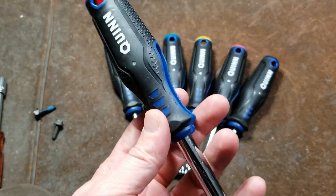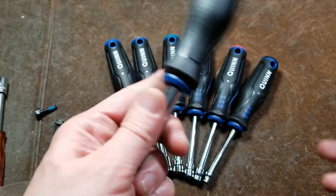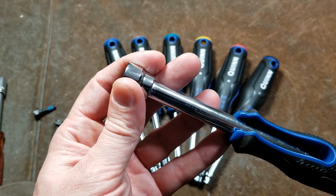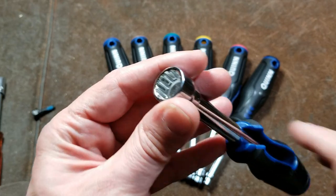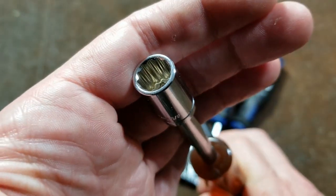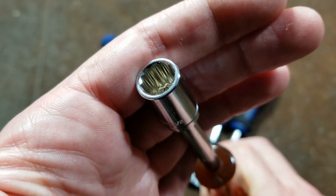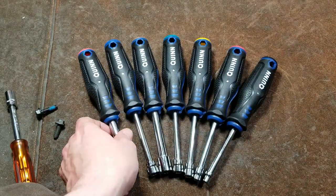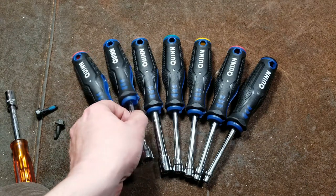The problem is they don't really work particularly well on fractional fasteners. They're really asking for trouble because they just don't grip quite as well as something that is actually designed for that size. On a standard socket, the flutes are more hexagonal, and that allows them to drive with a bit more surface area.